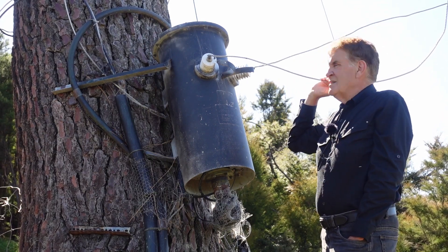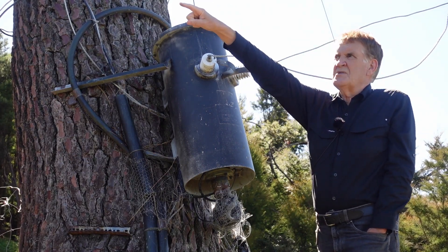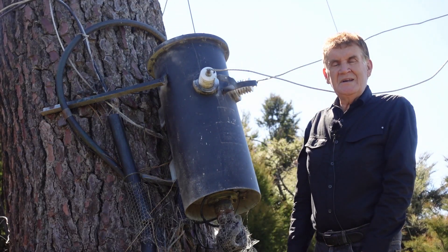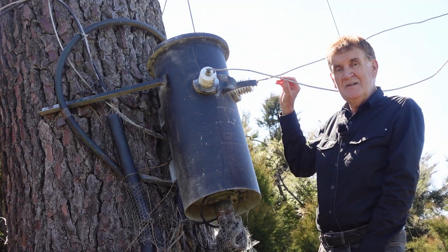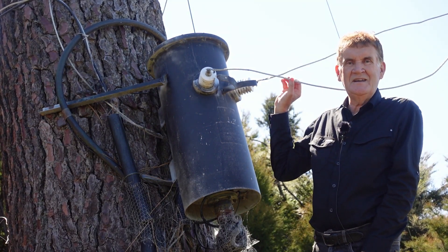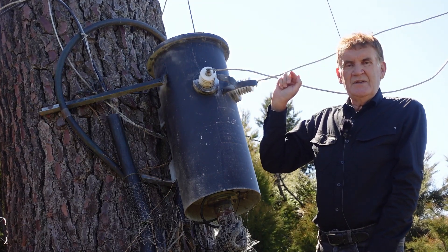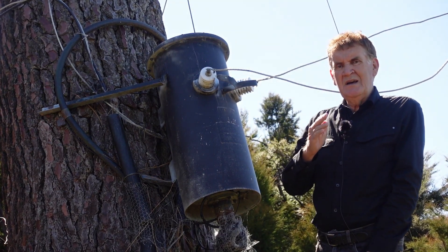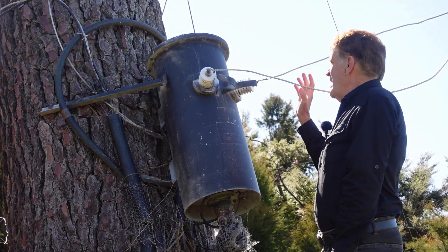At the moment I'm just doing some changes to the antenna — I've lowered it slightly and need to do a bit of work at the other end to tension it up. But the important thing with open wire line is to have your impedance spacing correct relative to wire diameter, and to have a cyclic twist. You remember the old 300 ohm open wire line for TV antennas — if installed correctly it would have a cyclic twist. The reason is that if there's interference from one side, both wires get exposed to it equally, so there's no potential difference between them and it doesn't see the interference.